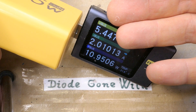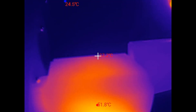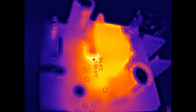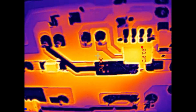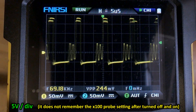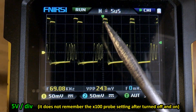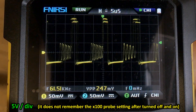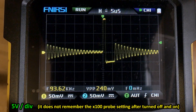I should leave it running at maximum current for a while to see what happens. After two hours, no failure. Thermal imaging of the box from outside and the internals shows the transformer seems to be the hottest part, along with the secondary electrolytic capacitor. On the bottom of the board, the primary switching chip is the hottest. Looking at the secondary on an oscilloscope, it's running at 68 kHz at full load. This appears to be discontinuous conduction mode: here the switching transistor is on, here the synchronous rectification chip is conducting, and here nothing is happening — just ringing. Gradually reducing the load, it seems to reduce frequency, suggesting a constant on-time mode.